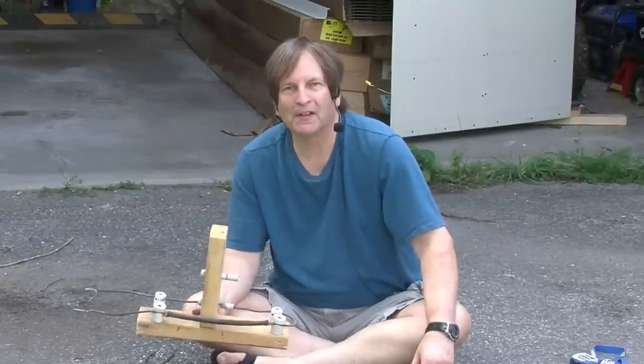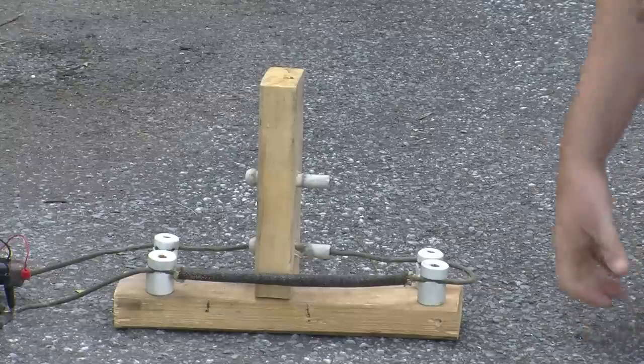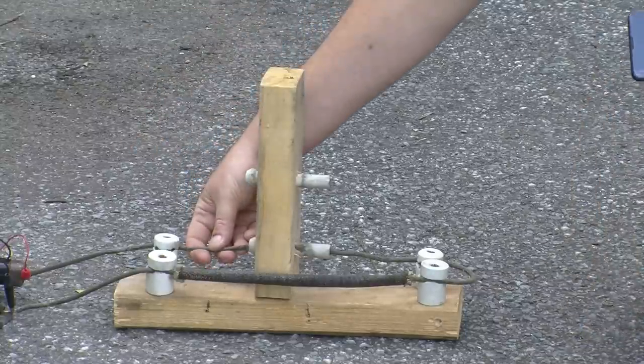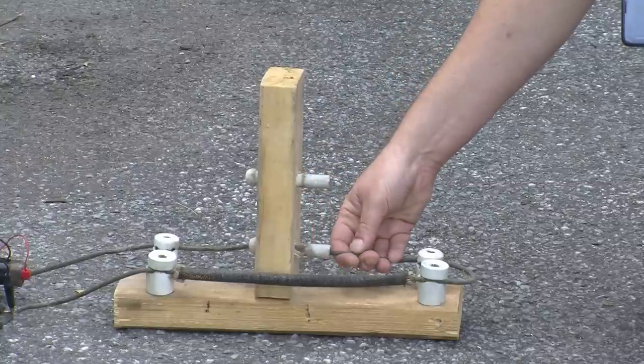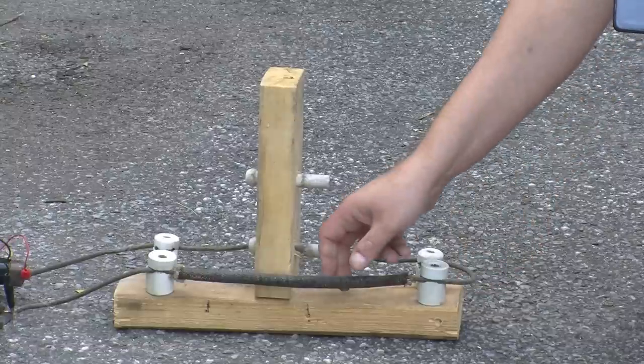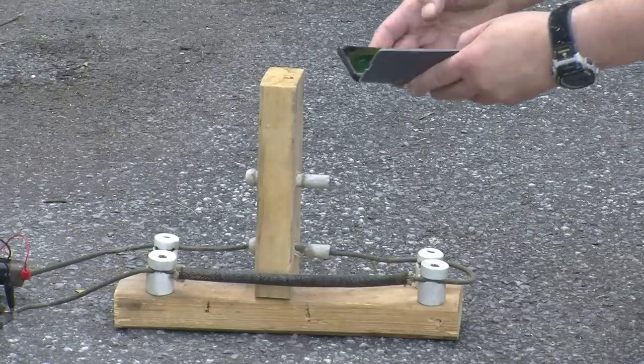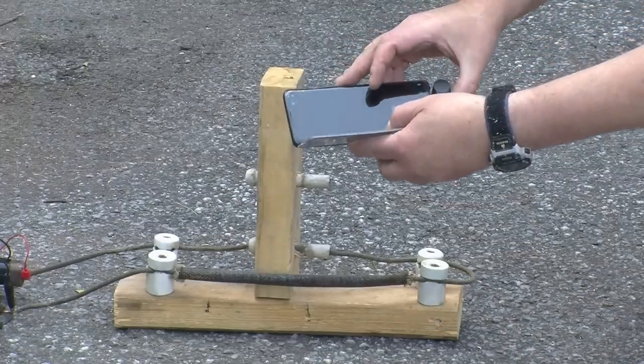So you have to take these tests with a grain of salt. That having been said, let's try it. Fifteen minutes later, at 15 amps — I think I can just barely detect a little bit of warmth. Obviously no devastating effects to the wire, as you'd hope. Let's look at it with the IR camera. We've maybe got a couple of degrees Celsius temperature rise — that's maybe 4 degrees Fahrenheit.